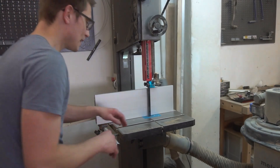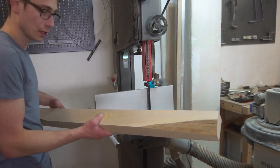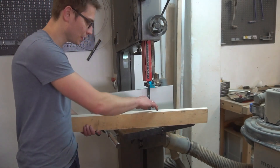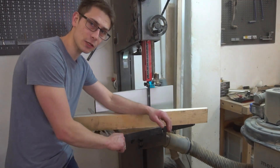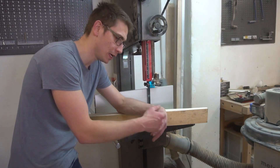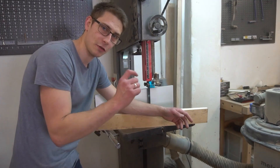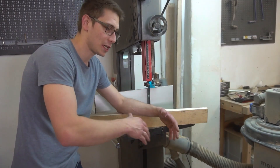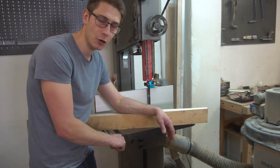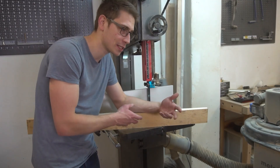Next up, the re-sawing process. If you don't know what re-sawing is, it's basically taking lumber — dimensional lumber or the like — and turning it into thinner boards. Re-sawing boards is the first step to really get your woodworking going. In a normal case, you buy your wood from a lumberyard and just hope that it's fine. And if it's too thick, you have to basically plane everything down and lose a lot of wood. But with re-sawing, you have so many options — you can turn thick boards into thinner boards, making two out of one and so on.